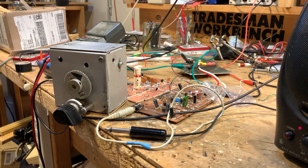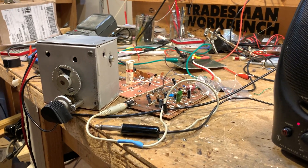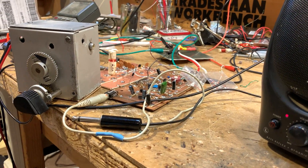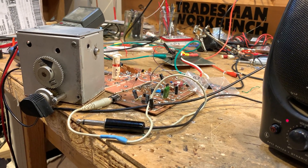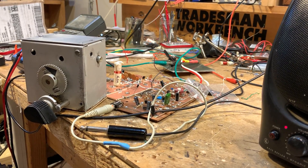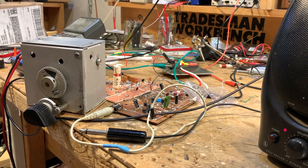Here's the evolving DC receiver. This box is out of the Galaxy G5 — it just has the capacitor. That board over there is the VFO board. It's a real simple VFO built around an air core coil built on a tube from a coat hanger — one of my favorite coil forms for VFOs — with a lot of NPO caps in there.